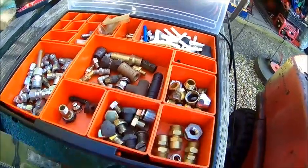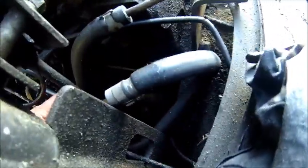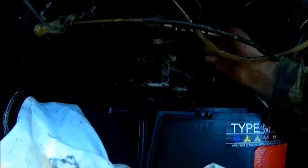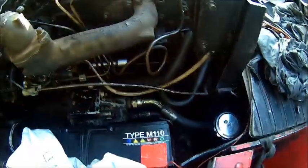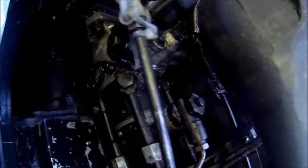The more I look at the fuel system, the more I think it's a hell of a mess. Look at that — that's where the fuel line comes in, and that's the return here. God knows who did that — it's a flexible pipe going into the pump. To get the injection line offs, you need one of these, otherwise you're not having fun. Because if you use something else, you may crack them — and that's what they are for. Look what happens when I move the throttle — the whole top of the injector pump is moving. And that's where fuel or oil is coming out.